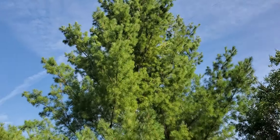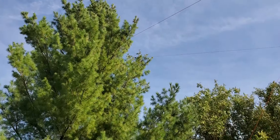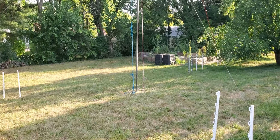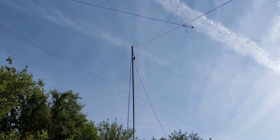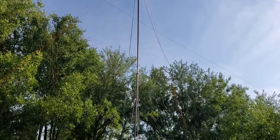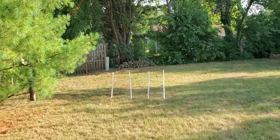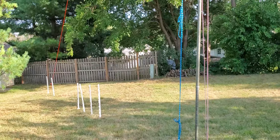On the 20-meter dipole I also put a bungee section in there, which I hope takes off some of the effects of the swaying — this pine swings quite a bit in strong winds. Another very temporary antenna is this pole right here — nine sections of four-foot sections, so you can calculate how high that is. I guyed it on two levels, just temporarily on the grass, and I have posts in so I don't run into the guy wires.